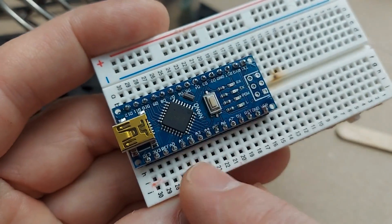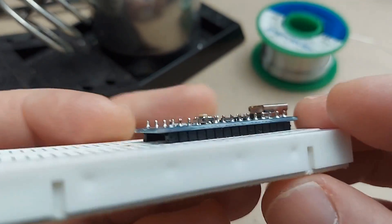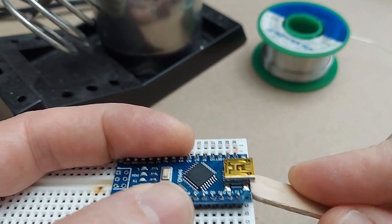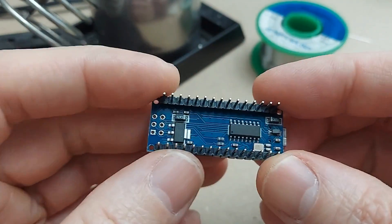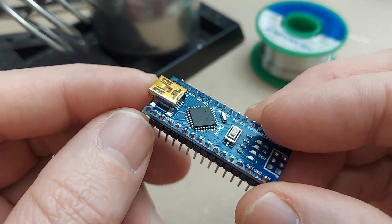All right, that's all done. Both sides seem like they're cleanly soldered — no cold welds, everything's well connected. When I go to pry this out of the breadboard I want to use my popsicle stick because I do not want to bend up the lovely little legs I just finished soldering. Get that out of there without bending the legs — there we go, ready for production. That's how I go about soldering headers onto a little Arduino Nano board like this. Hopefully that's informative; please mash those buttons, give me comments if you got them, and I'll see you next time.